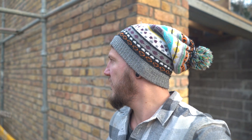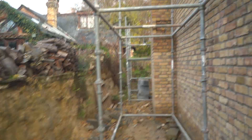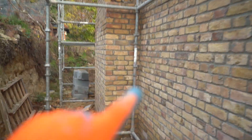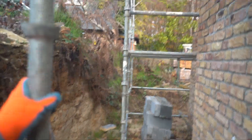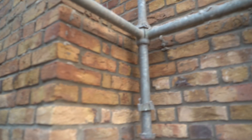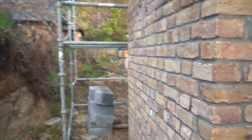Very simple to do — I'll grab a hammer and show you how it's done. This is the quickest scaffolding you'll ever see, but I don't find it's sturdy enough. If you have enough to go all the way around in a square, it's a lot more sturdy. However, you can't go around funny shapes like this chimney stack — you can see I've got one section that finishes here and another that finishes here with nothing connecting the two sections. I did have a running board over there but it's a bit wobbly.